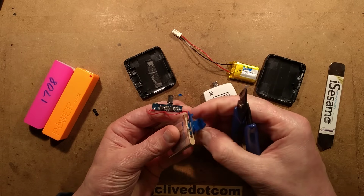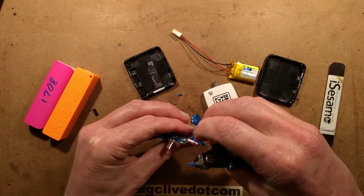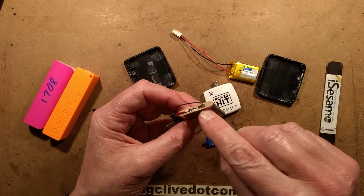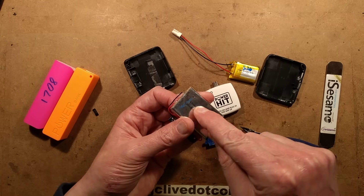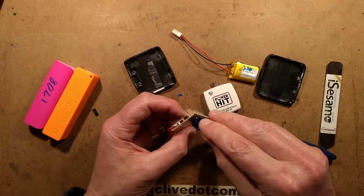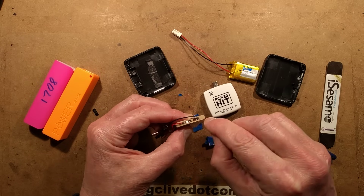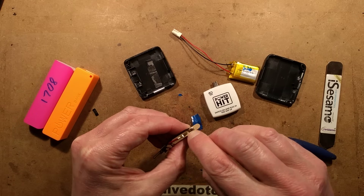What we've got here is the metal case for the battery and there's no protection circuit on it. It isn't designed to protect against overcharge or over discharge — they don't give a damn because it's only going to get used once apparently. If you peel this cardboard off, the positive tab is directly spot welded onto the case. The negative tab has a little dimple that comes through the case with a tiny moat around it, and then a spot welded terminal onto the top of that. It's very close around the case — just the way it's designed.